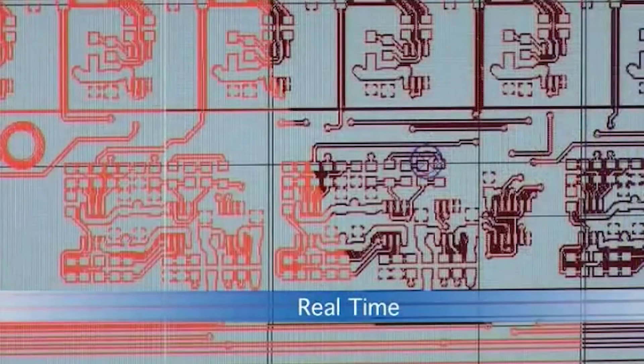This process allows for large areas of copper to be fully laser etched with the protolaser S and U3 models, and this is achieved at speeds of approximately 1 square inch per minute for full removal.